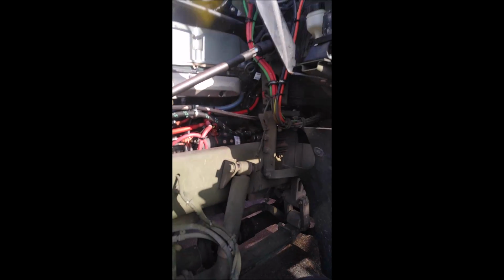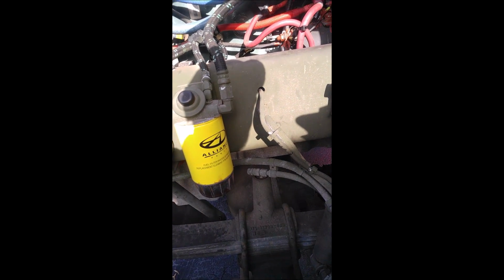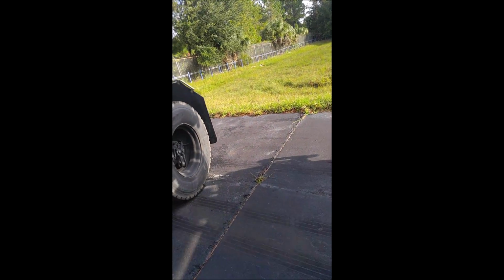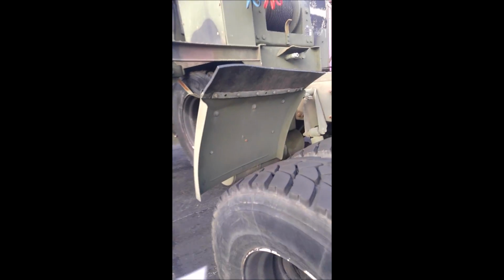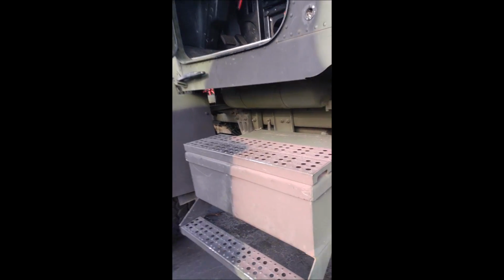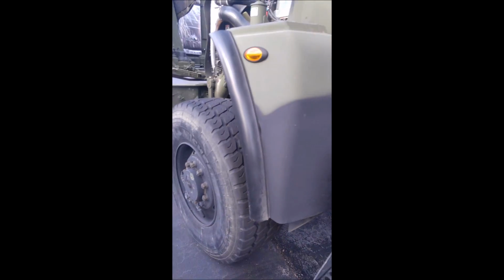Well, basically, I went through most of the checks. I would check your steering, make sure that none of these need to be replaced, none of your ball joints. These are pretty big ball joints or sway bars. You want to make sure that your brakes, I think I mentioned your brakes already, are within 2 inches so that it passes DOT inspection. You can get pulled over on the side of the road, and these guys will screw you on it, man. They will get you, and they will make sure that everything on your truck is within spec and within the right service manufacturer specifications.